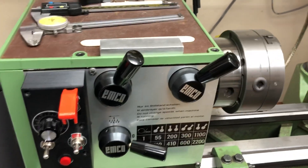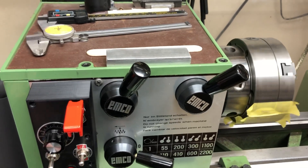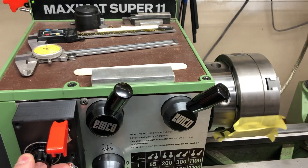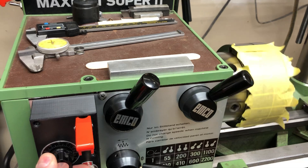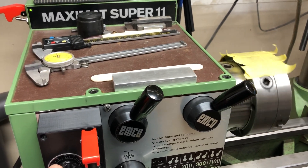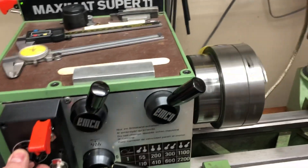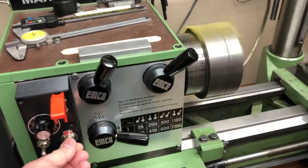The minimum speed is pretty slow — I think that's about two Hertz. I use the low speed windings on the motor. The high speed ones don't get you anything except a loss of torque and it's not as smooth. So I use the low speed windings and then double the frequency going in from 60 to 120 Hz, ending up with the same maximum speed the factory intended for the motor.